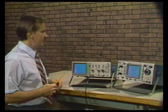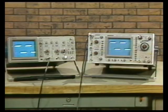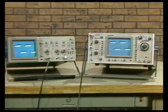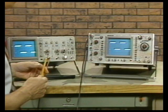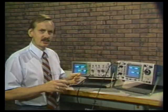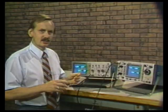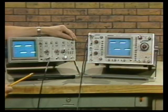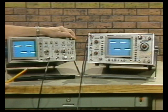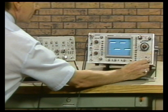Let's take a look at the CRT performance. I've set the intensity to maximum in both scopes with a 100 kilohertz square wave input. From where I'm standing, the Tektronix 2215A is brighter than the LBO 517 — which surprises me a little because the LBO 517 has a 20 kilovolt CRT and the 2215A has a 14 kilovolt CRT. Adjusting the hold-off time changes the brightness, which may partially explain why the LBO 517 is dimmer.